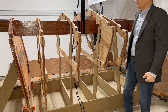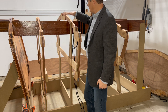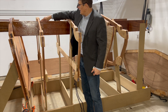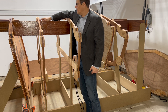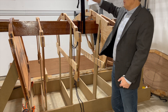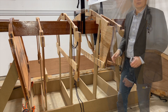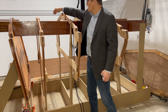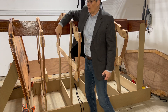An important point I want to explain is: as I was putting on frame number 10, it became clear that we drop these frames down and then we have to line up the waterline down below. The frame height on the inside of the transom is actually higher than the stringer, and it made me realize that back here I don't really know the angle or the height at which the stringers should be held. So what I ended up doing was going to the 3D model and measuring the height from the inside edge and the top and the bottom down to the waterline.